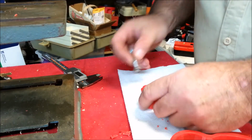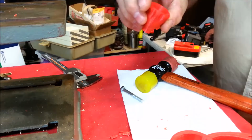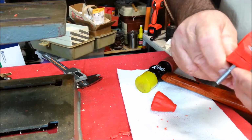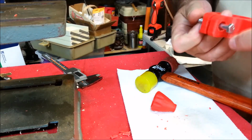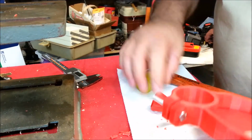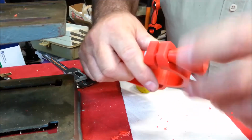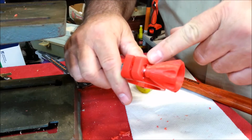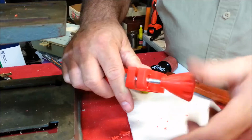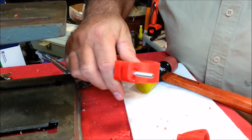On the 1/4-20 nut, this gives me metal threads. Yeah, that's a little tighter now. I'd like that a little tighter yet. That's something I'm tweaking on. And notice I put radiuses here as well. And when I did that, that meant I no longer would have a flat surface here for the tightening knob. So I had to inset a little flat surface there.